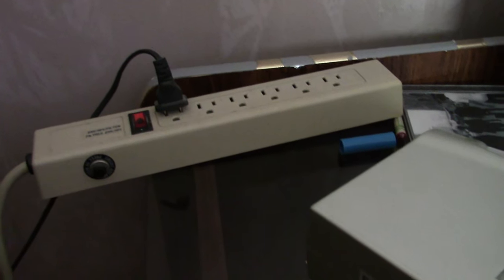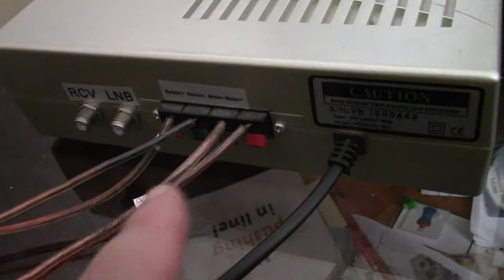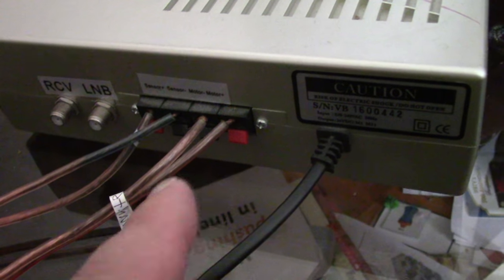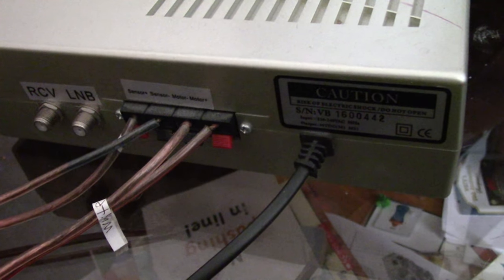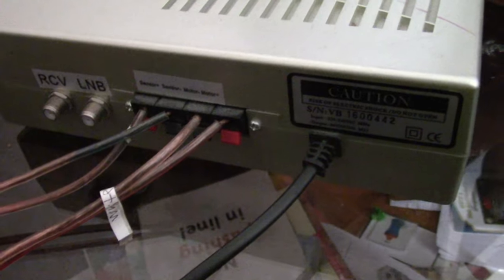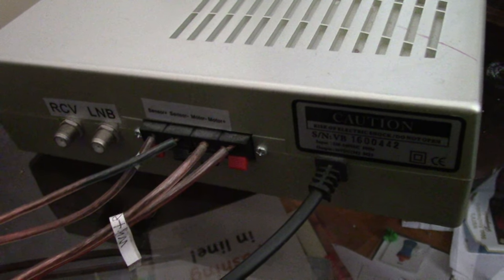At the back of my dish positioner there's a power cord plugged into a power bar — it doesn't use a whole lot of power to move the dish. There are four wires going outside to the actuator: the main power which powers the motor and switches polarity for forward and back. You can actually move your actuator with a car battery by changing the polarity, just make sure you don't connect to the reed sensor wires. Some actuators are so old the diagrams inside have worn off.